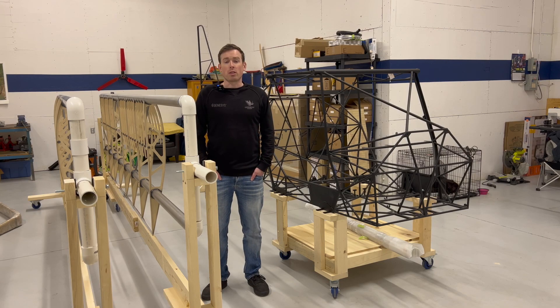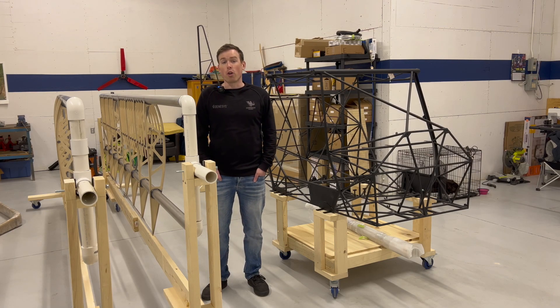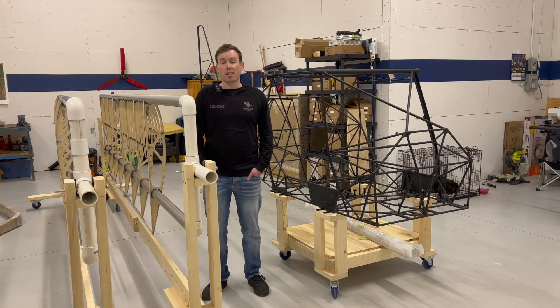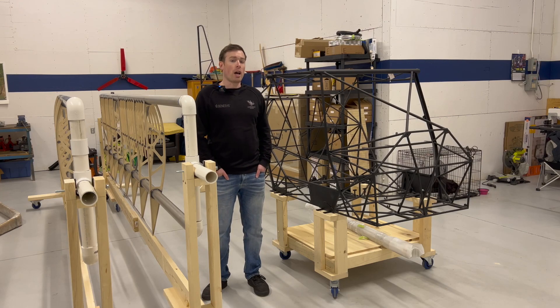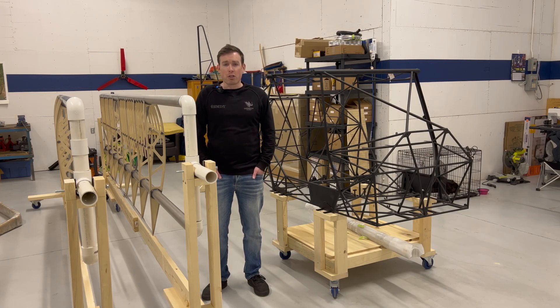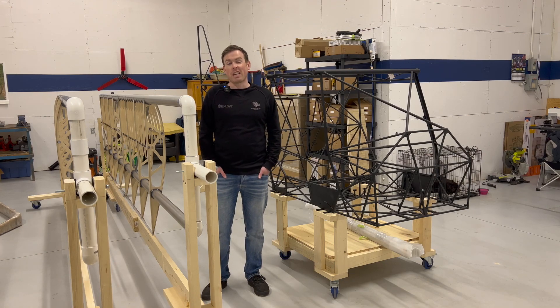After the kit arrived, the first thing I did was send what's called a letter of intent to the MDRA Inspection Service. The MDRA Inspection Service is the governing body tasked with overseeing the construction process of home-built aircraft and issuing their special certificates of airworthiness. The letter of intent is just a simple form you fill out — it's primarily a notification that you're about to start building an aircraft. After MDRA receives the letter, they provide you with a file number that you use in ongoing communications and to arrange inspections. There are commonly two inspections: the first is called the pre-cover inspection, done before the aircraft skin is put on so that areas inaccessible after skinning can be inspected; the second is the final inspection, which happens at the end when you're ready to fly.